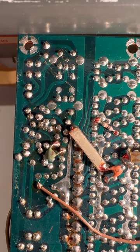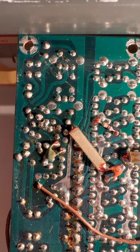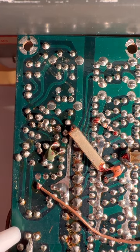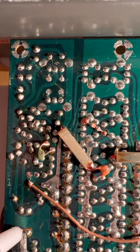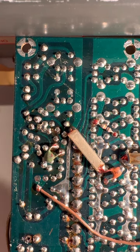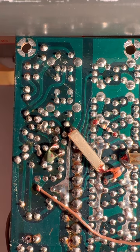I'm just going to use a solder sucker here. The camera might actually be in the way for me to angle in. They're saying to use solder wick, but let's see - it's right in the camera view. It did a pretty good job. I hate solder wick actually; it really seems like it destroys the board.